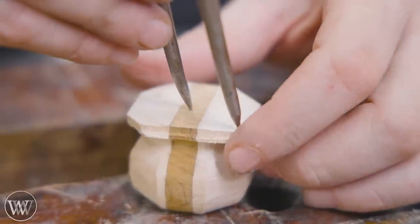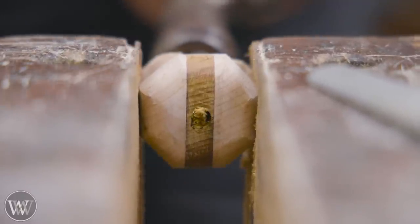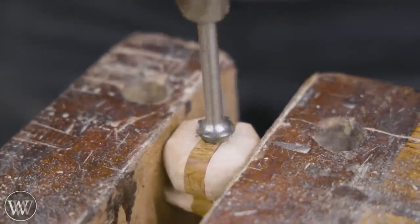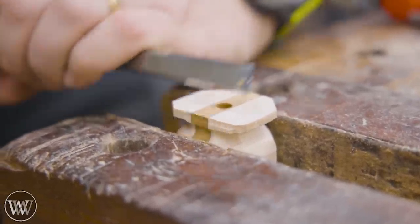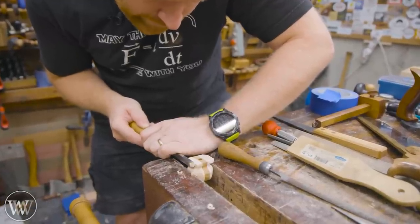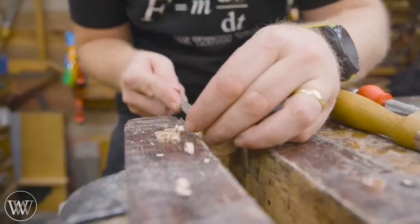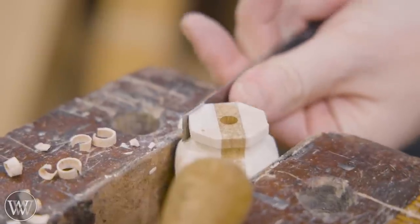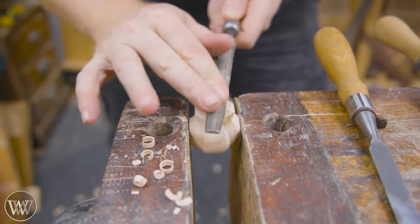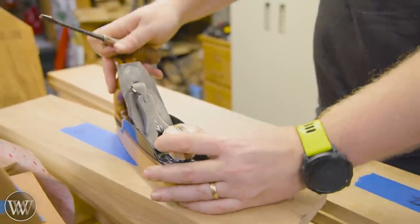The last step is connecting the smallest point on the knob up to the rounded section, using a heavy rasp to get the majority off and then a smaller rasp and smaller file. Once we get to roughly the right shape, we slowly detail this down. One last thing: I need to cut off the lip around the outside and make it a diagonal. Before that, let's bore this hole from one side to the other — my hole was ever so slightly off, so I had to come back in with the rat-tail file and ream it back to center. Then I'll chamfer the top corner and bevel it down so the flat-head screw fits, and octagonalize the bottom with a chisel, since we're working cross-grain and the curls come off in weird chunky pieces.